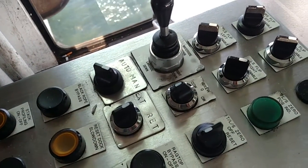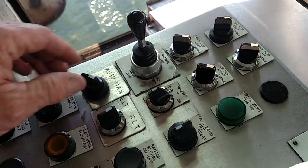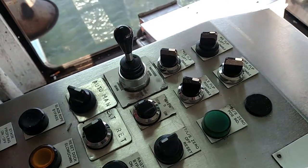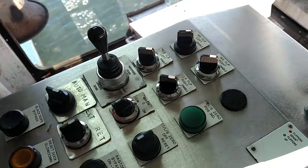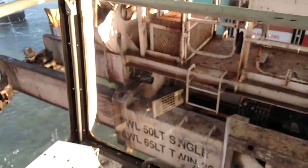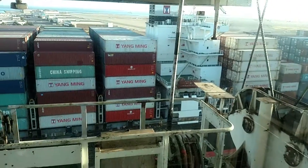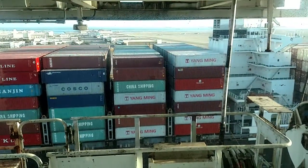And then when I get going down the cell, I just bump it off short, nice and easy as you can see in the videos. As I'm going down I pop it right back into auto and that'll open up the beam, and I put a little tilt on it and there you go. If anybody was interested in learning how to do that Scotty squeeze technique — the Lord Jesus Christ showed me how to do that. What do you think about that? Wow.